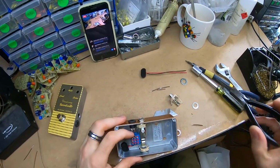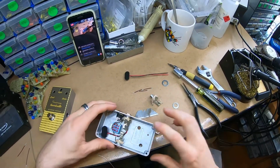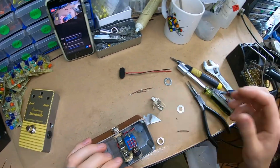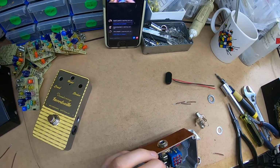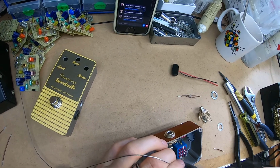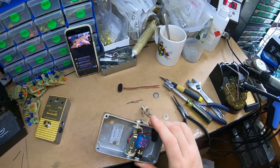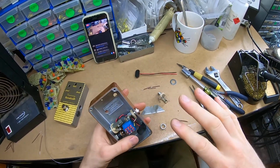Before I solder that in, I'm going to push it aside so that there's a gap from those rubbery DC lines. This is Teflon wire, but those ones I don't want to accidentally touch, or plus I don't want the audio sitting right beside the power line. I'm just coming in from one direction, I can't get underneath. So I've just tried to get the minimum amount to blob across and get out.